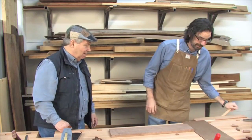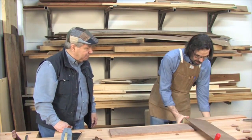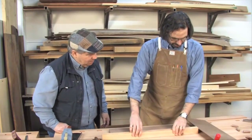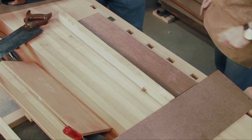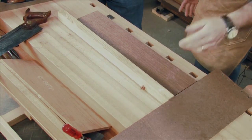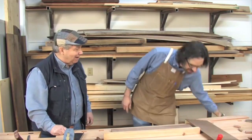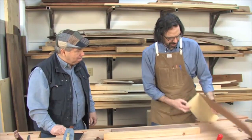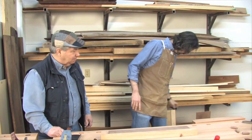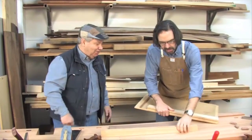It's simple. You can also rotate it up a little bit and plane thick stock — you can get it up almost six inches off the bench. It's only two pieces of wood and you pretty much don't have to use a tail vise. That's wonderful. So that's my planing jig I use all the time — it handles the faces of the boards. What about the ends and the edges?